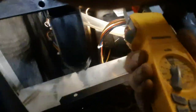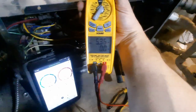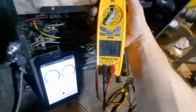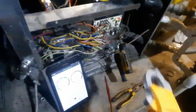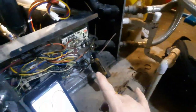Let's see if we can get an amp reading. 5 amps — that blower's going bad. Rating was 3.4 or 3.6 — it started off fairly normal but after you run it for a few minutes we're at 3.6. That motor's going to lock up again on me. I'm sure I had a lockout but I didn't see it because I killed the power since this guy was humming. Nonetheless, we found an issue.